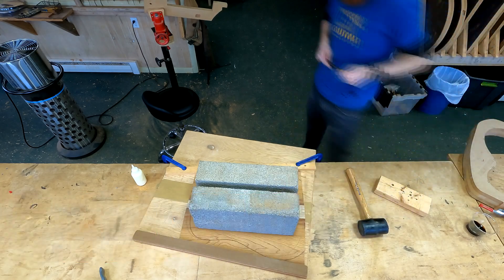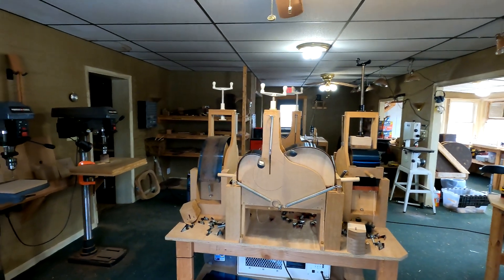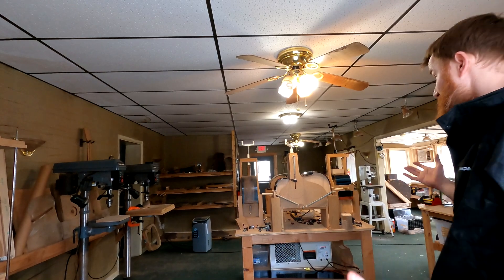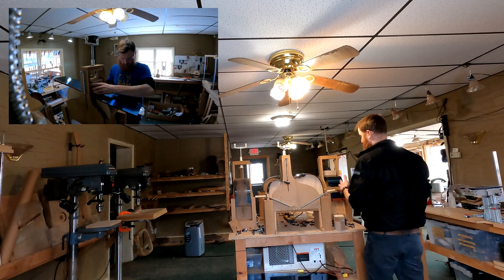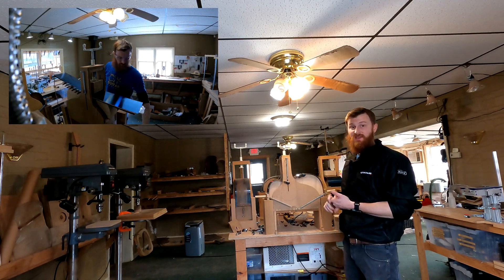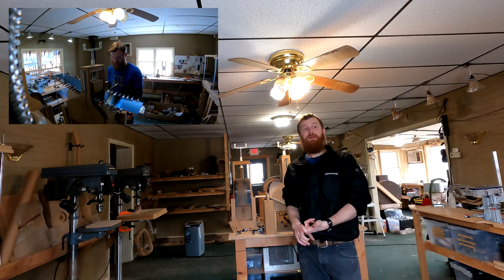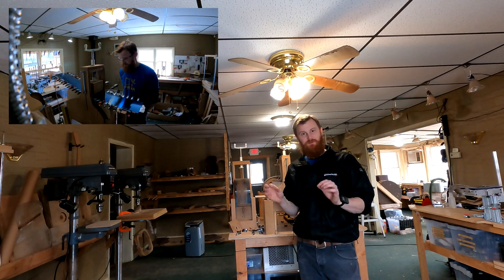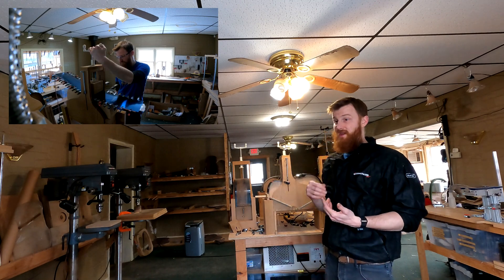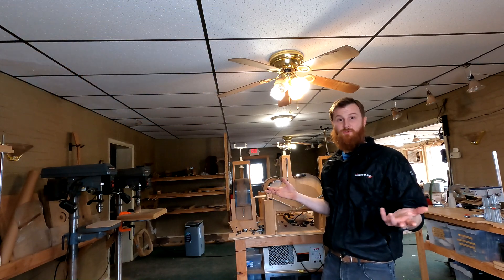In addition to joining the back plate, I also bent the set of sides. Here are my side bending carousels — really just a workbench with four different side bending machines so I can bend enough sides for two guitars at once. I only did one guitar in this case, so two machines were used. I thicknessed the Nicaraguan Rosewood to 85 thousandths of an inch. Probably could have done 90, but since this was a very unique set, it made the sides irreplaceable. In cases where I can't easily replace a set aesthetically, I like to err on the side of caution and make it a little bit thinner to avoid compression marks and cracks.